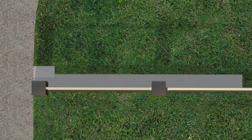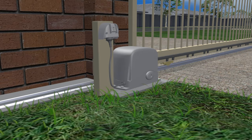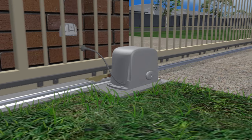If the motor is to have its power hard-wired or other cabling is required, then conduits may be placed in the motor pad when it's being poured. If the motor is to be powered from an outdoor power outlet, this can be placed on a small post next to the motor — not on the fence, otherwise how will the power cord get past the gate?